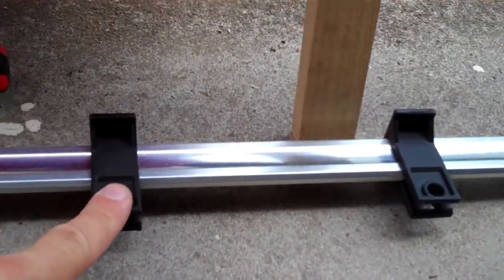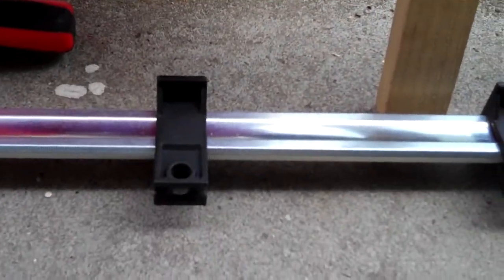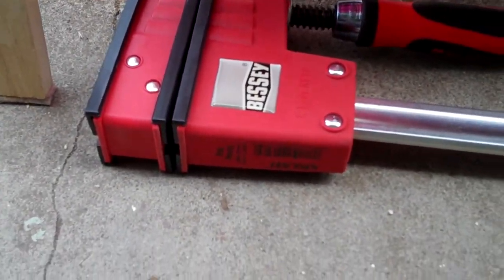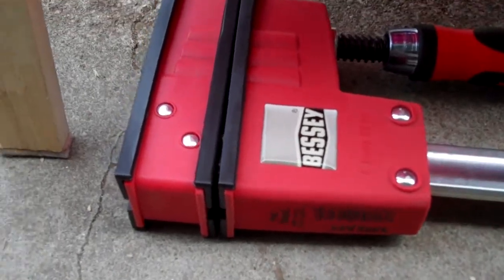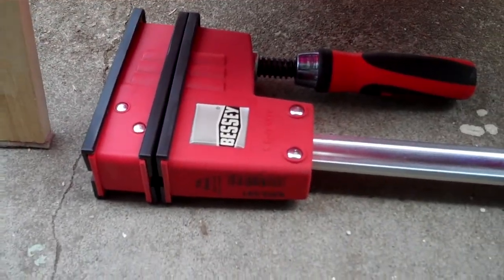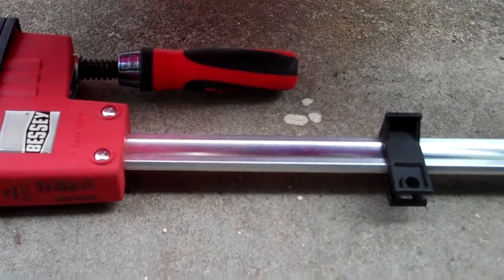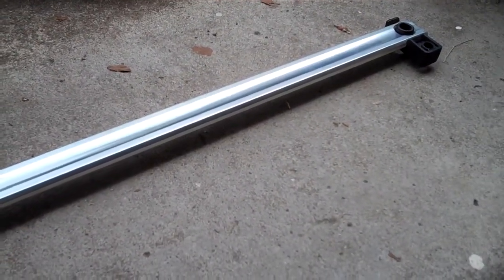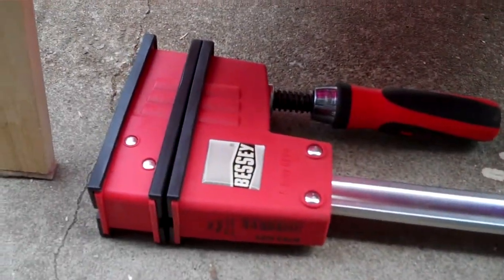In addition, you have the ability to lay these different pieces flat on the surface and create a sort of table clamp. You can even use the holes in them to clamp down to a table, which is really powerful. It's not something you typically have to do, but when you find yourself doing some awkward woodworking and you'd like a big clamp but don't have a big enough workspace for a dedicated woodworking table with clamps built in, it's a really nice piece. You can actually get by without some of the bigger equipment and still do real woodworking techniques.